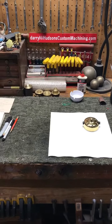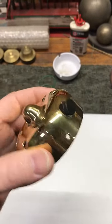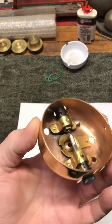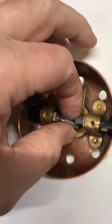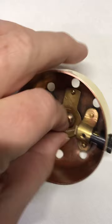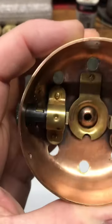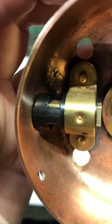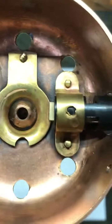Okay, here we are for part two — the before and after of the Westinghouse all-brass end bell. You can see I've got the brush insulators made, and the brush just comes out from in there. There's what it looks like, and you can see right here where we've got this part cut away for that clip to clip onto the wires coming off the motor — that's where it clips on to make continuity through that brush sleeve.